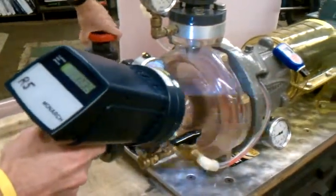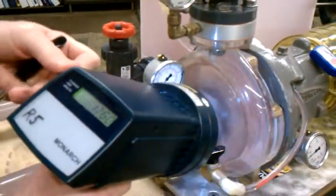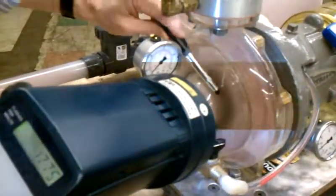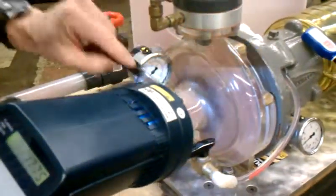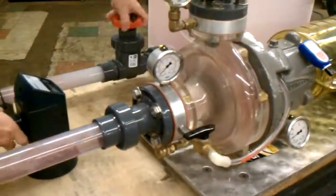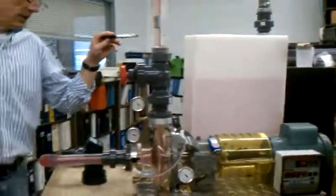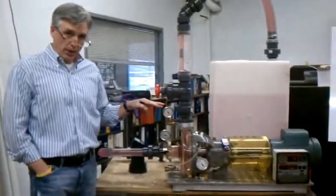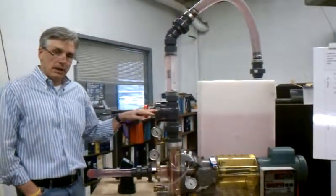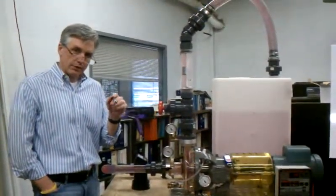In addition, by closing our suction valve, what we can do is demonstrate cavitation. All throughout here now we're actually forcing this pump to run into cavitation, so you can visually see the damage that is done to a pump over time when you run a pump in cavitation. So what we're trying to demonstrate is all the different ways that you can run a pump, verify performance, and understand all the effects of open valves, closed valves, and the performance of the pump.